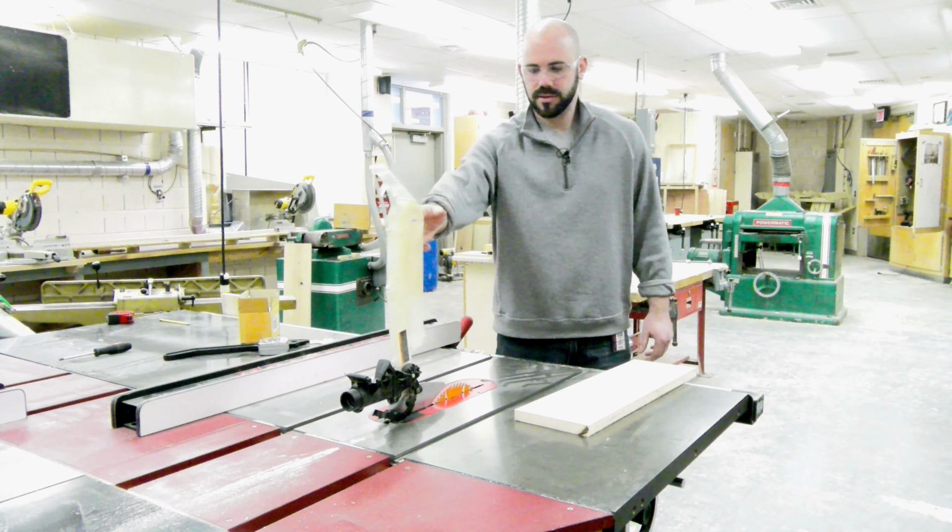So, I can now turn on my main power disconnect of my saw. We are actually getting ready to actively make a cut. Make sure the table saw is clear and free of debris, such as pencils or any other object. I'm going to throw the main paddle to turn this saw on, and watch my procedure as I work through this saw. Everything we just discussed will actually take place in very fluid action. Standing to the left, pointer finger, thumb, planted. I start feeding.